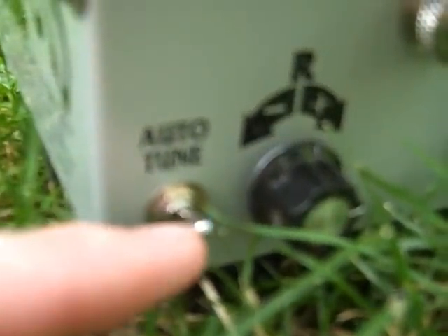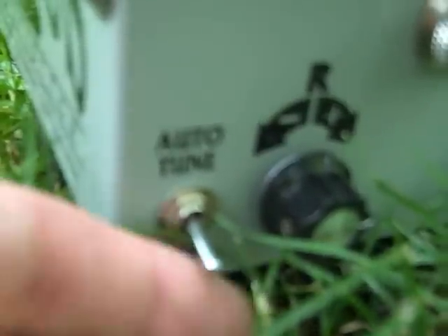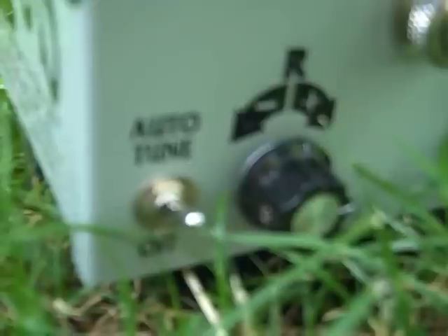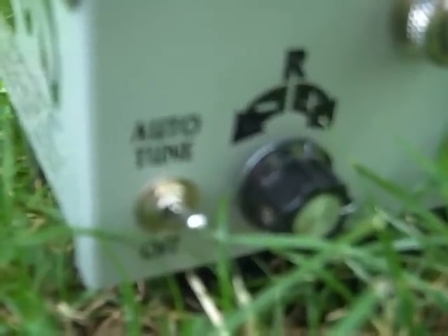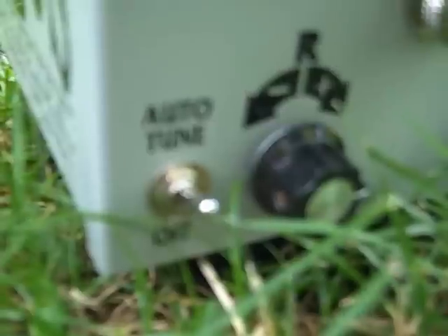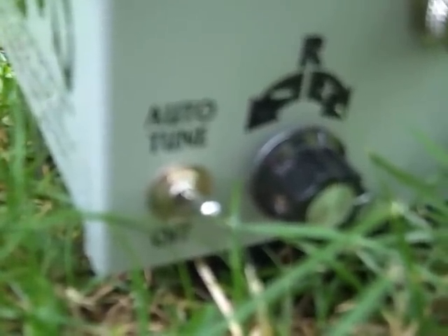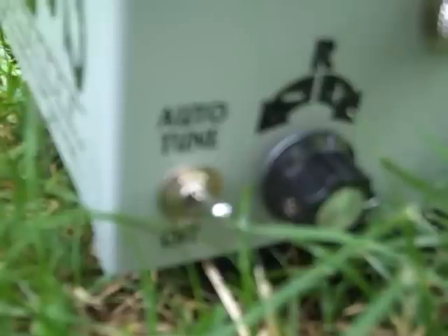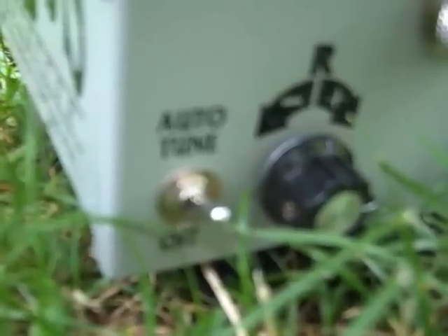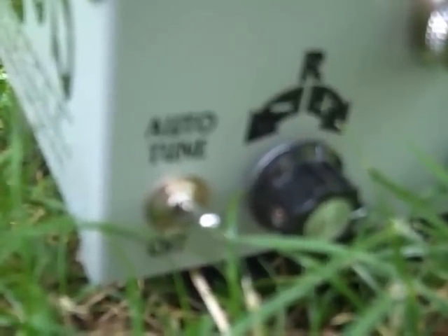There's a very useful little switch here — it's the auto tune on or off, and that affects only the all metal channel. Generally I run with auto tune on, as that smooths out the threshold a bit more. If you turn auto tune off, then the detector is a true all metal detector on the all metal channel, meaning you can leave the coil directly over a target and it won't tune it out at all — there's no slow re-tuning with that off.